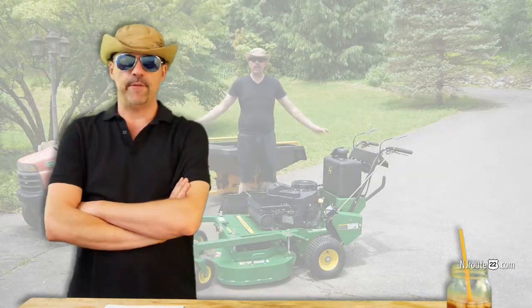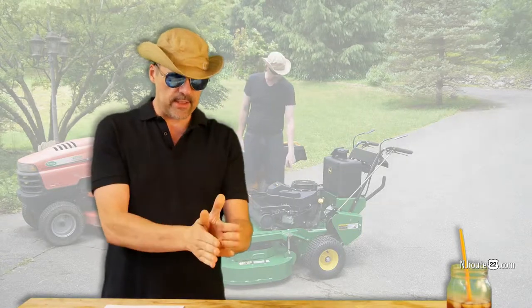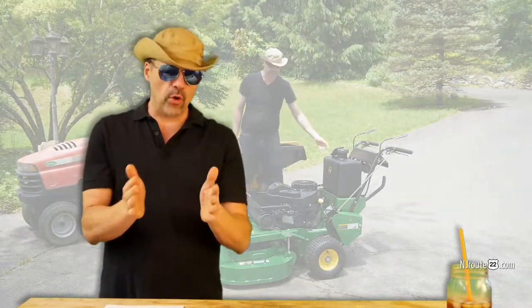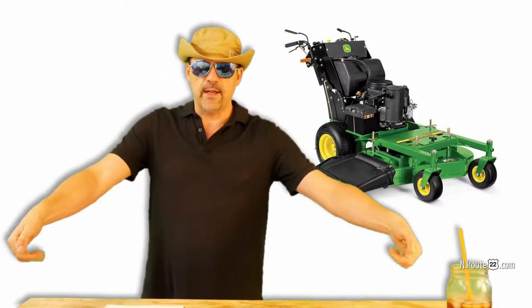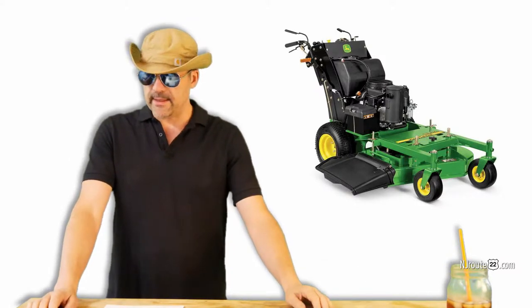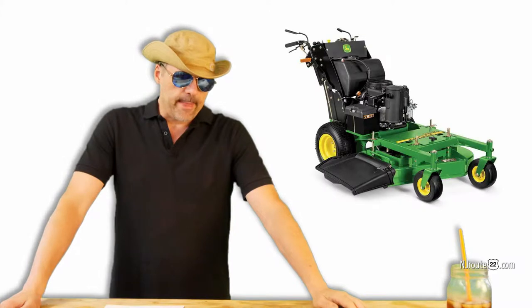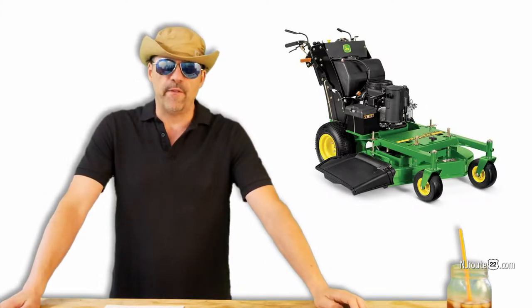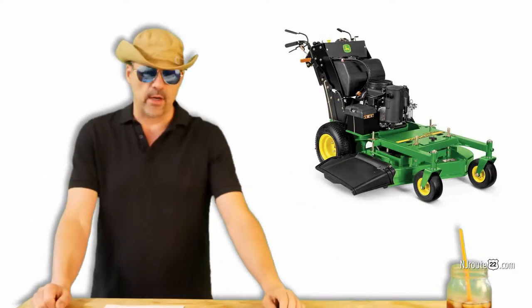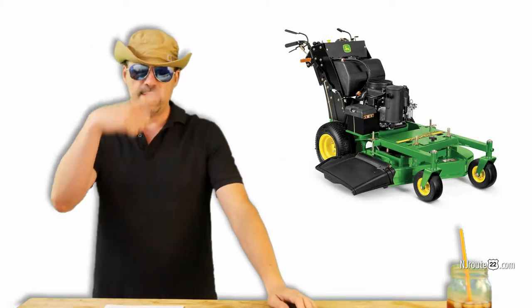There are differences — good and bad for each. This John Deere hydro model has two independent power levels, one per side, and you never get them perfectly even; it will always track slightly to one side. You can almost get it straight on level ground, but it's a pain to balance the power levels, and you have to tweak each side of the steering to go straight on a hill. Mowing on hills is not easy for any commercial walk-behind mower. That said, the gear model was much harder to steer on hills, it skidded more often and got off track way more. When I first used the hydro I thought it was just as hard, but after using it a couple of times I'm very happy we went with the hydro. Let me show you some footage of me mowing this hill on the hydro.